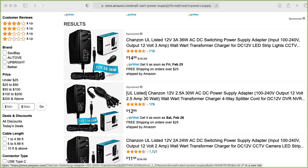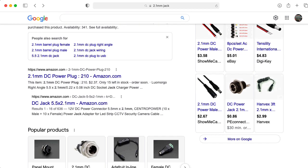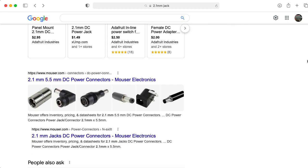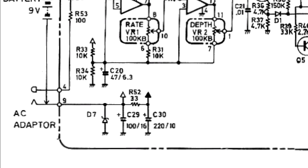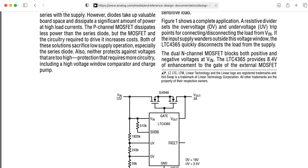Fuses and circuit breakers are all about current. Let's also talk about overvoltage protection, which I think of as having three different domains. The first is when someone plugs a power supply of a higher voltage into a device expecting a lower voltage — say, a 12-volt supply into something expecting 5 volts. This is a particular problem given the ubiquity of the 2.1mm DC power jack. Protection here could be as simple as a zener diode strapped across the power supply input, as in the Boss CE-2 chorus pedal, though more sophisticated techniques use MOSFETs as switches.